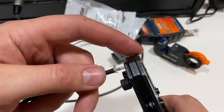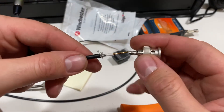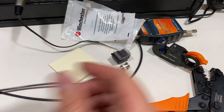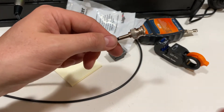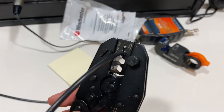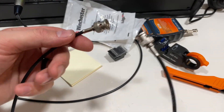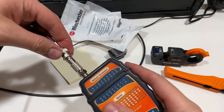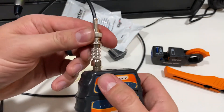We're going to take that, crimp the pin, so that's now on. Take our end, put our end in, and then the slit all the way down the other side. We're just going to pull this guy up, align that, and that goes into our crimp tool just like that, and then crimp that all the way down. We've got both ends on. Take our handy cable tester, plug that in, plug that in. Two pins each side. We're good to go. That'll pass SDI.